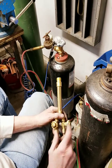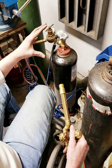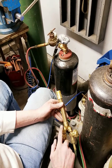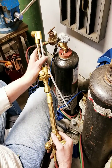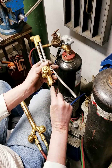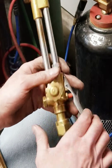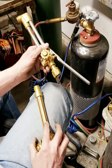If this valve is holding fine, you open it up with the cutting attachment on, and there's a leak on that inner tube, oxygen will flow from the oxygen side, jump over to the acetylene side, and flow out the end of the torch. That makes it really difficult to tell what is leaking. If you've got a leak you can't figure out, a lot of the time it's in the handle. Sometimes there's a crack in the cone end, or where the cone end screws into the body of the torch — it can also leak between those two sides.